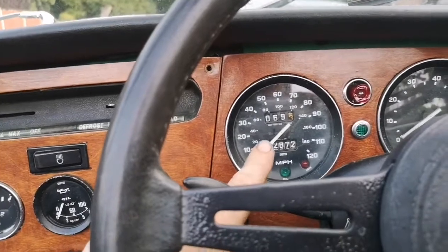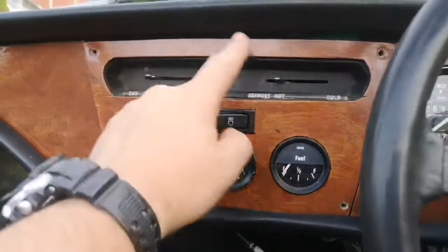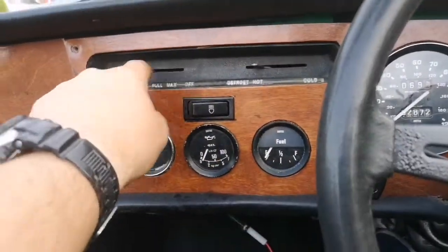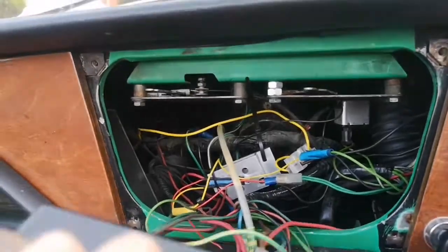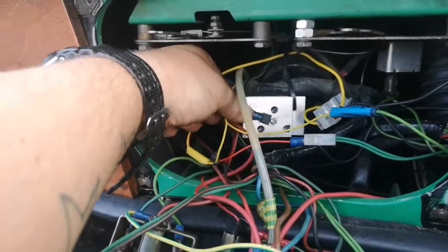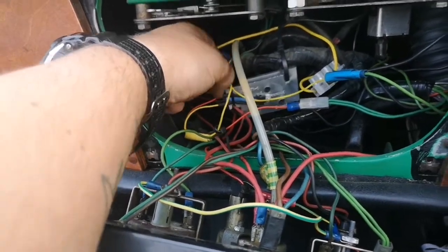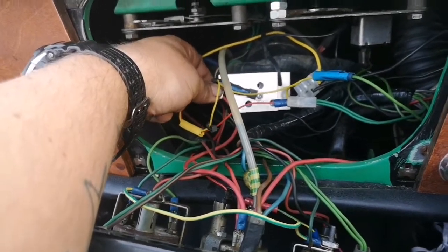I had a look and there's nothing located on the back of the clock, which led me to believe it's been changed at some stage. So I took the four screws out, pulled it off, used two little grub screws with allen keys to get the knobs off, and pulled it forward. There it is — this looks like a voltage regulator to me, screwed onto that piece of aluminium, and it's very very hot, so I've got a feeling it's not doing its job. We've got another one to fit on there.